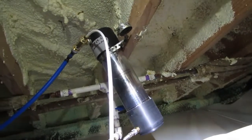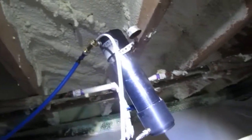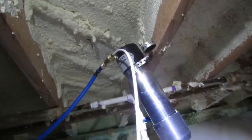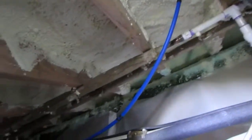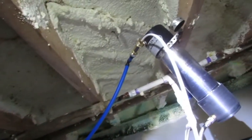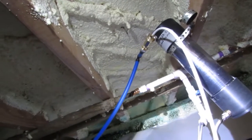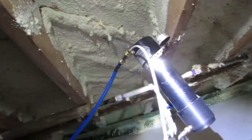This is what the water is going to look like — it's a charcoal color, which is to be expected. That was in the directions; it said you would see some of that. They recommend that you flush this for about five minutes and it will eventually clear up. I went ahead and purged it down here as well to get the air out of the filter. I'm going to purge it again upstairs, both with the ice maker side and the line that goes up to the sink, to get the air out of them. Once I connect it up to the sink, I'll probably let it run another five minutes.